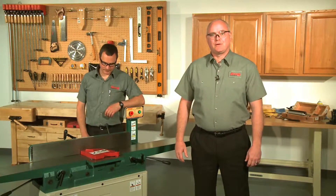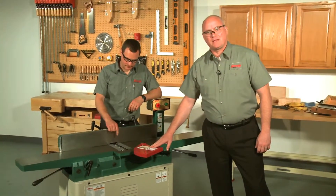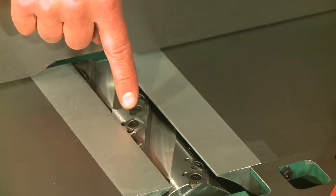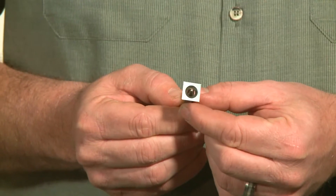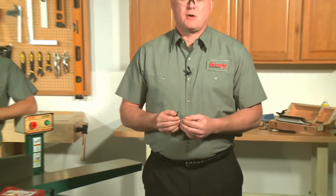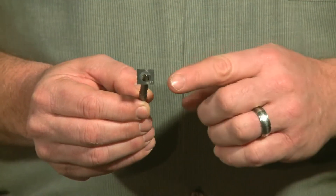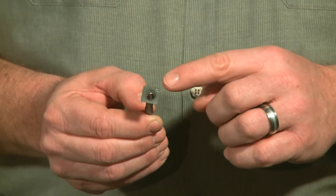Now we're going to show you how to rotate or change the inserts. Grizzly cutter heads are equipped with four-sided carbide inserts. This is much harder than high-speed steel so they last much longer before they go dull. The other advantage with the four sides is that when they do start to dull they can be rotated for a new factory sharp edge. And if for some reason you hit a nail or some small foreign object, you only need to replace a few of the inserts instead of a whole set of regular knives. To help you keep track of which sides are new and which are dull, these inserts have an index mark in one corner. When the mark revolves around to its starting position, the insert should be replaced.